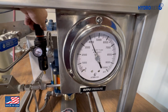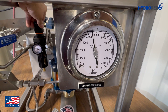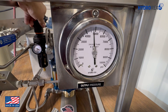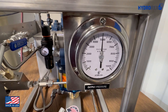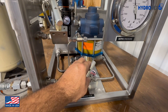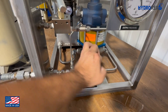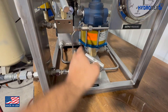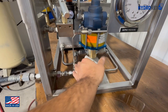I am doing a 5,000 PSI test just for demonstration. If your requirement is to hold the pressure at zero leakage for 5 to 15 minutes, for example, then we close the isolation valve to keep the pressure isolated from the injection point to the pumping system.